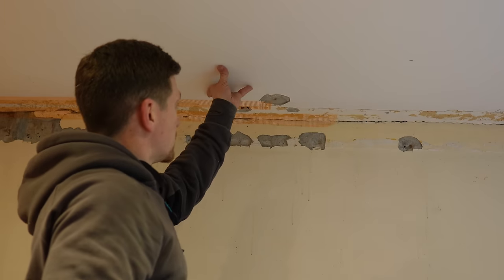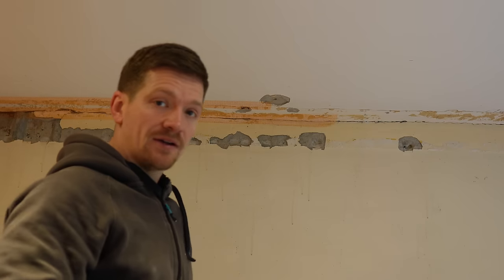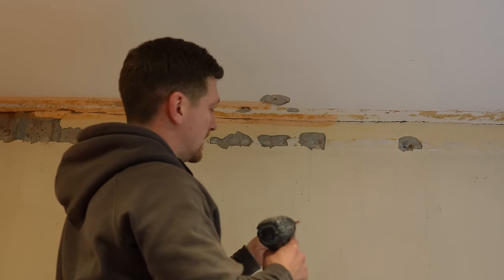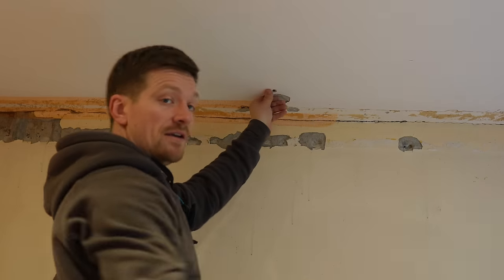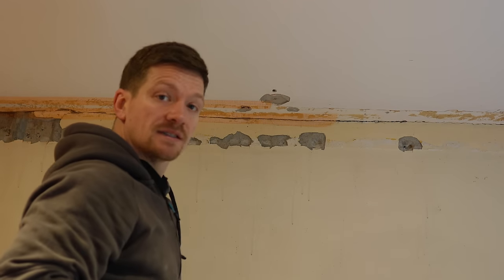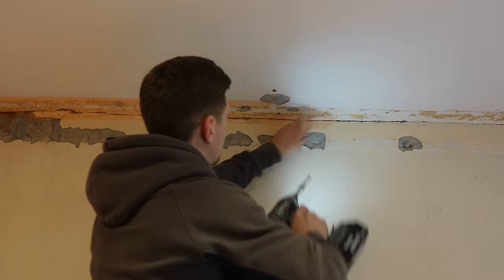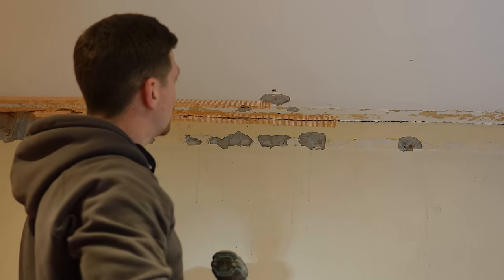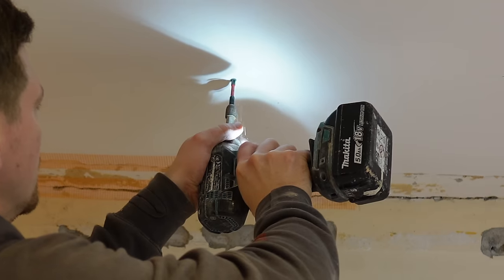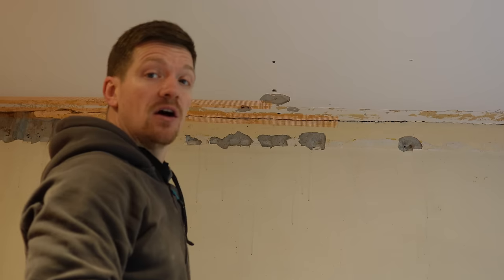I'm also finding there's a bit of movement in the ceiling, which is quite common with old ceilings where clout nails were used. Clout nails are not great because they do eventually pull away. I'm going to reinforce that ceiling with a few screws — if you ever see an area where it looks like it's dropping a little bit, whack a few screws in all the way back to the edge. I'm also putting scrim tape in the edges where the walls meet the ceiling along the coving line to help future-proof the whole room and prevent any callbacks.